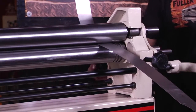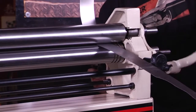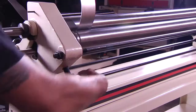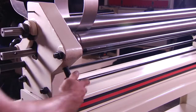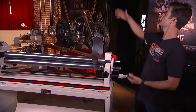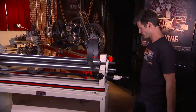When I roll that, there's another handle in the back. That's going to bring the back roller up and change your arc or change your roll. As you're coming along — see, that's actually too much, I can pull it back — I'm going to go a little bit more straight. The endless opportunities of shapes that you can make with these: drive shaft tunnels, HVAC. Make tubing and such. Nice tool.